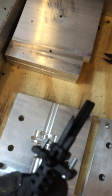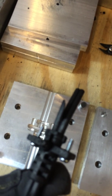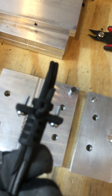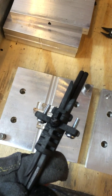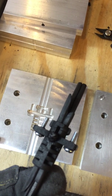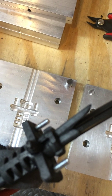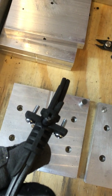I've pulled the piece out of the mold, separated it, and you can see a little bit of flash here. For Santoprene, it gets a lot tougher as it gets cooler. So one of the things I do right away is pull that flash off. Typically because there's a seam there, it'll pull off pretty easily — you can just snap it right off.